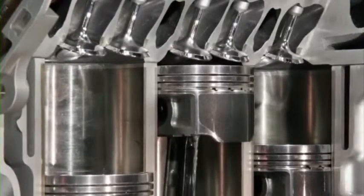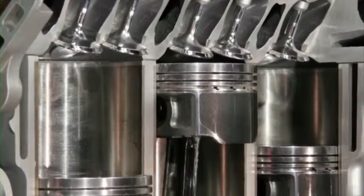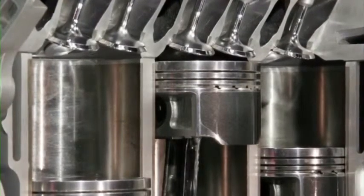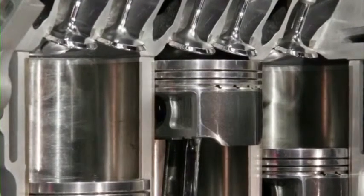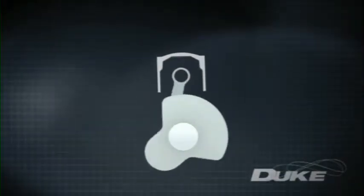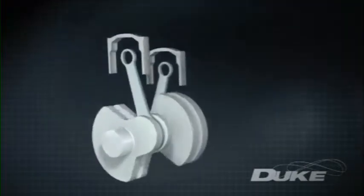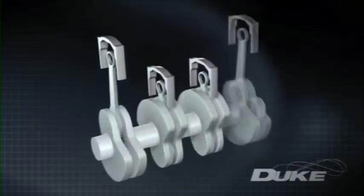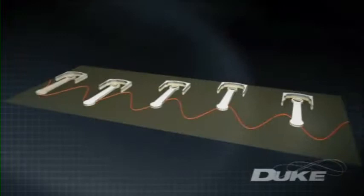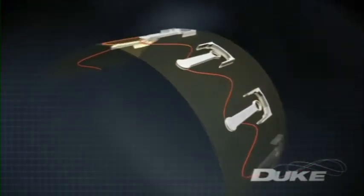A standard internal combustion engine works when a fuel charge is ignited under pressure, pushing a piston down a cylinder, where its linear motion is converted via conrod into rotational motion of a heavy crankshaft held in an even heavier block. To increase power, numbers of cylinders are repeated in rows, either inline or in a V configuration, introducing even more weight and complexity. The Duke engine reforms this linear arrangement into a circle, creating a true axial engine.